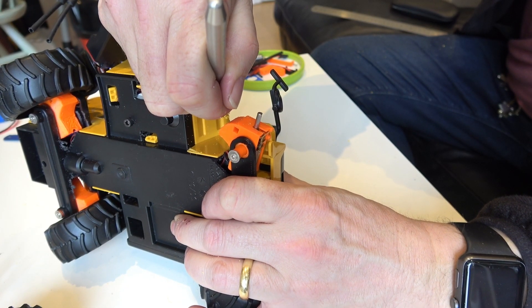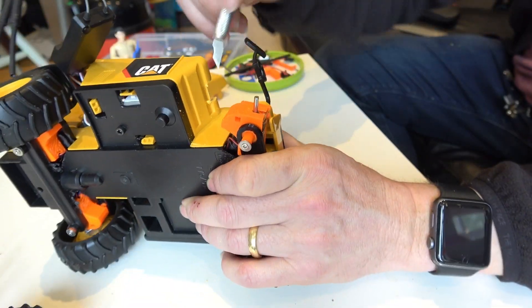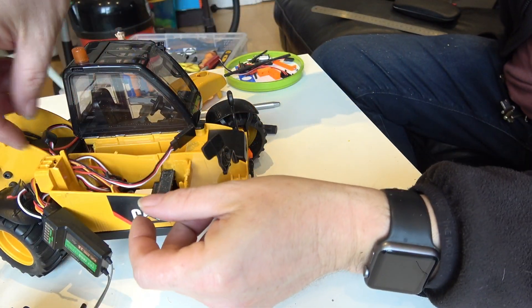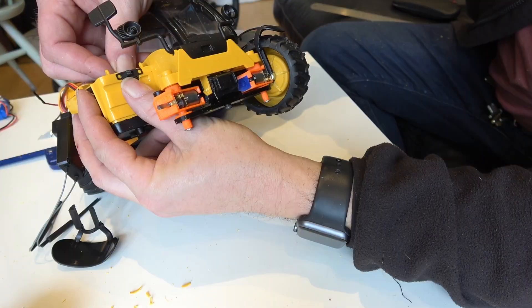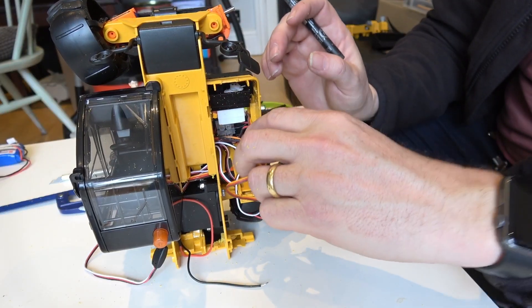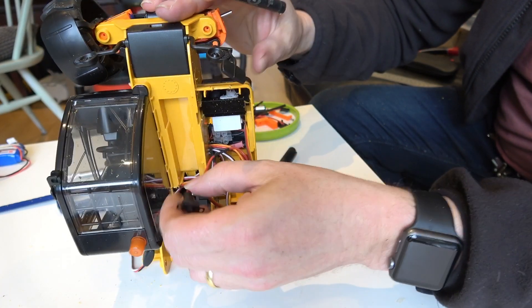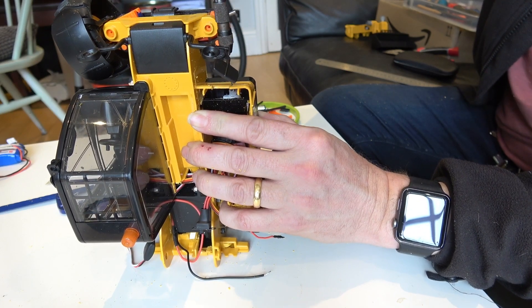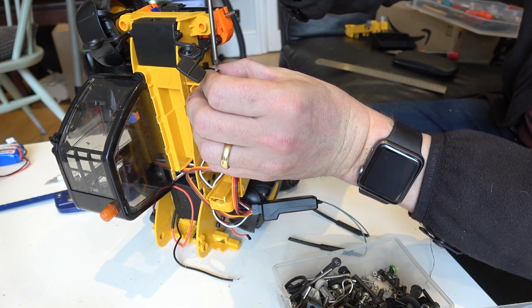Score it across and then just bend it out with the pliers. Clean it up. That should be a good fit for our on/off switch — it's going to sit in there and that looks fine. Taking the marker pen, mark the very centres of the holes. Use a one and a half millimetre drill bit, and then secure with a couple of two millimetre bolts.